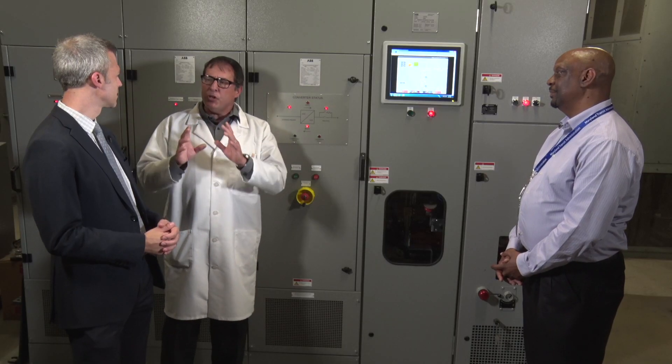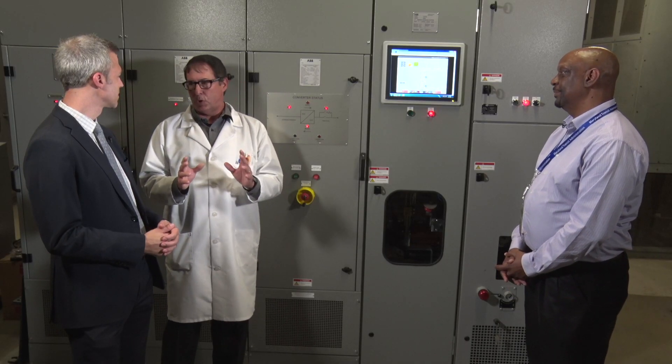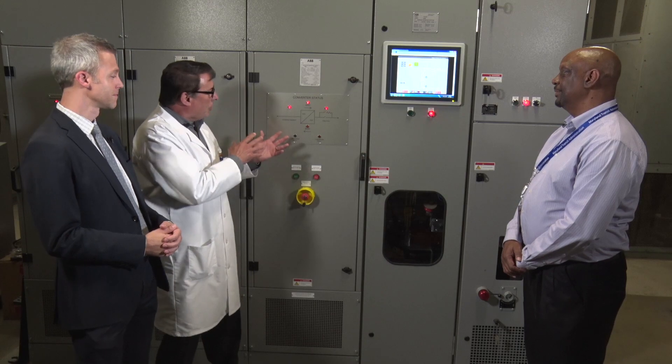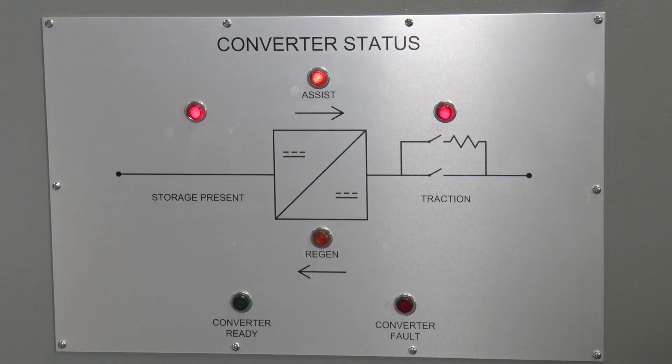So, how does it work, Professor Verne? The system monitors the third rail, and when voltage reaches a certain high level, this means a train is doing regenerative braking, and the system captures and stores the energy in supercapacitors. What is a supercapacitor? Engineers use either capacitors or batteries to store energy. Capacitors are low-power, fast-acting devices, while batteries are high-power but slower devices. A supercapacitor, also called an ultracapacitor, has the properties of both — it's a newer technology capacitor that's both high-power and fast-acting. Now observe the indicators on the unit. It shows the system is discharging stored energy.